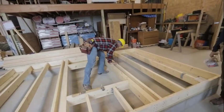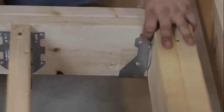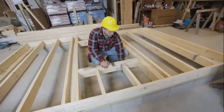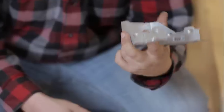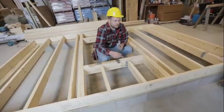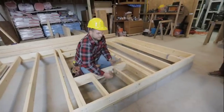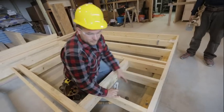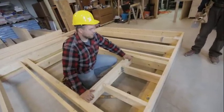These double headers — very same concept, it's just a double-wide joist hanger. You may be wondering why we're not putting these on every single joist. You only need a joist hanger when you don't have anything supporting underneath. On the exterior, we have a good four inches of mud sill — there's good bearing on this sill for the joist to sit, so no extra support is needed. But where a joist or header doesn't have any support, we'll put hangers on those.